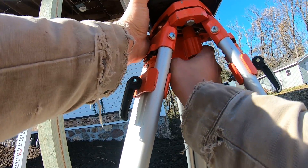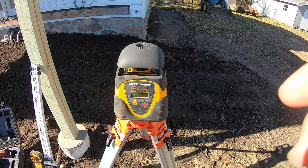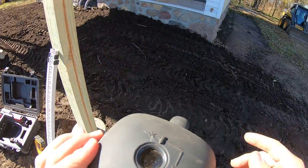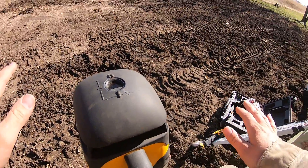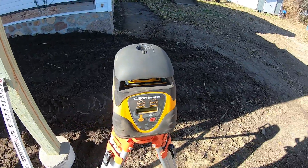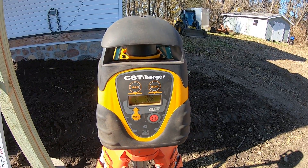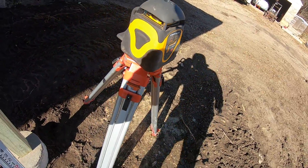I'm going to go ahead and anchor this on the top of this tripod. You always want to move these things when they're off — you don't want to have them on at all while you're moving them around. You'll see right on top of this particular one we have an X and a Y axis, basically the directions of slope we can calculate going in either direction. We're going to go ahead and turn this thing on and it will automatically start to level itself. Right now it's set at 0 and 0, so it's going to shoot a perfectly flat laser beam, and that's what we want to start out as.